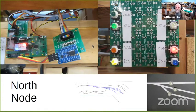This was an initial experimental installation. This was that board I made for those tactile LEDs, and I just stuffed it with these eight buttons and wired them to this lash up with this ribbon cable, and this blue board on yours, another I/O expander. And again, these resistors are taking care of my screw up on not providing pull-up resistors.